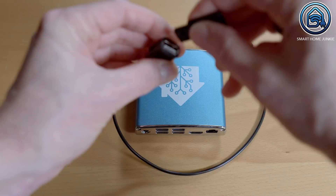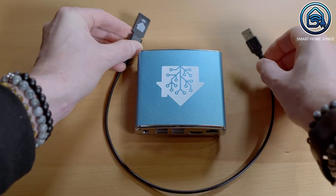It's still a matter of time until Thread devices will be available so that you can use them too. The stick can be updated using Home Assistant, so you will always be able to run the latest firmware on the stick easily. Let's do a quick installation on ZHA — installing the SkyConnect in Home Assistant for Zigbee is straightforward. Just plug the SkyConnect using the extension cable into your Home Assistant server.